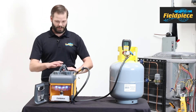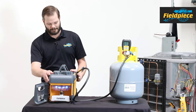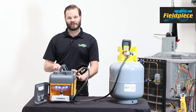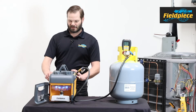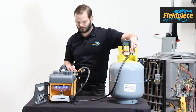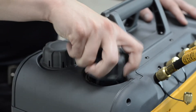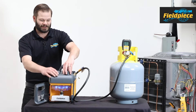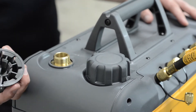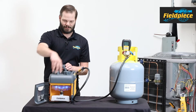Let's go through the demo on what this sounds like and how the oil management system works. I'm going to flip it on its back. First I'll flip on the gas ballast just to show you what that sounds like — I have my light on, then I can close that up. I'm going to open up my tank and start pulling a vacuum on this tank right here. I have two knobs up here: one is where I put my new oil, and the second one is for exhaust — right now it's just exhausting like it normally would. I can remove it and add a hose if I'm in a tight spot to put the exhaust outside.